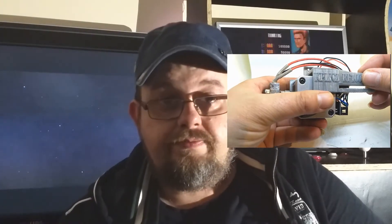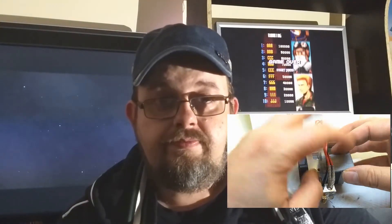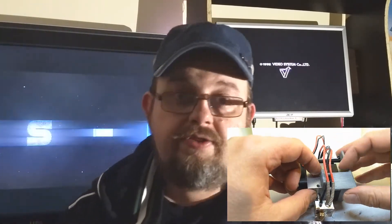So I screwed the original fan on the original position just because I wanted to mount the turbo fan for part cooling on it. But then the printed bracket doesn't fit — there's no way. And the duct seems to be far from the nozzle. So I decided to design a new duct and bracket, but this is the point of my next video.